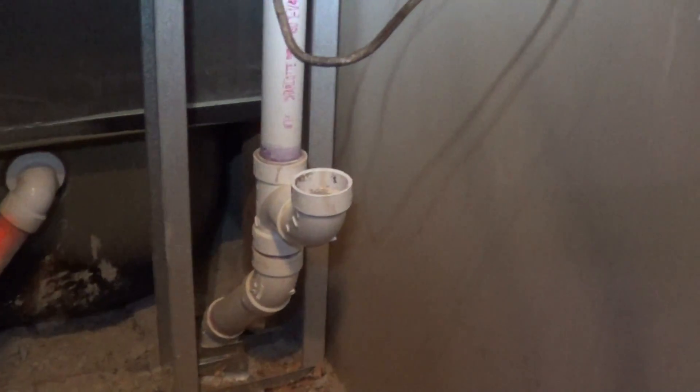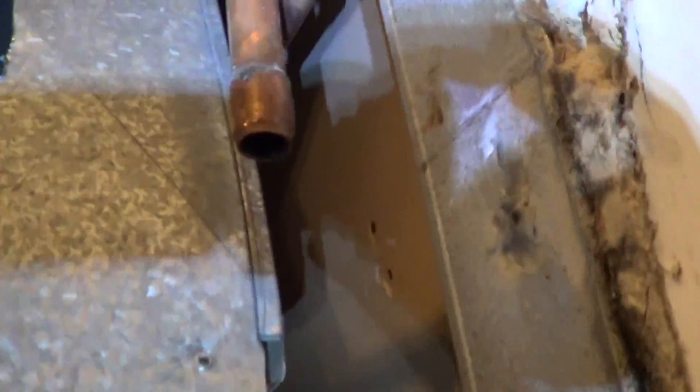Here's the main drain which gets cleaned at the same time the unit gets cleaned. Here's the refrigerant piping which comes downstairs. There's the heater piping — there's one, there's the other back there. I'm going to go ahead and seal up the connections on the ductwork up top because I can crawl inside here, and also I can seal up and take a look inside.